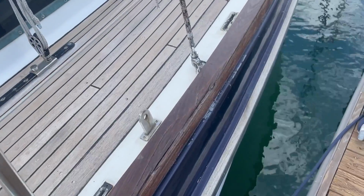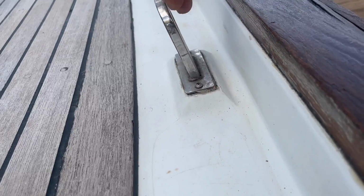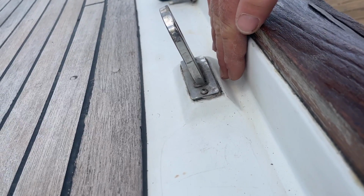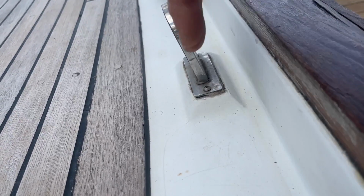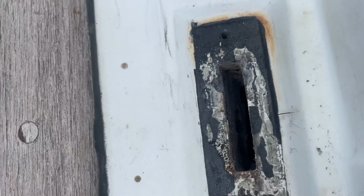So we are going to end up grinding down these plinths and putting them down to the deck. There's just too many angles that this plate needs to go through, and this angle and onto the hull. Those plates that they're going to now weld on were the ones that caused that knee to rot out. So I'd rather have that sealed up and bolted down.